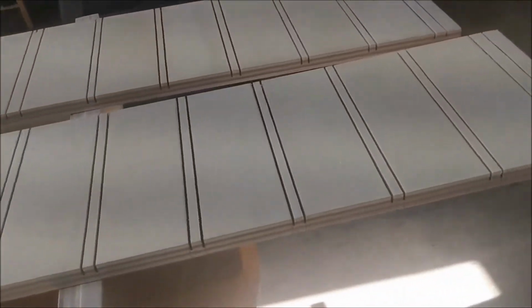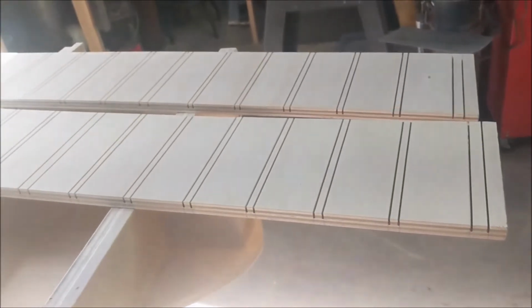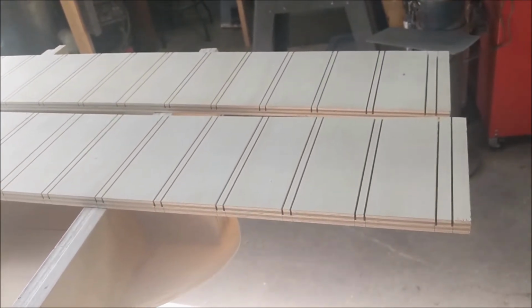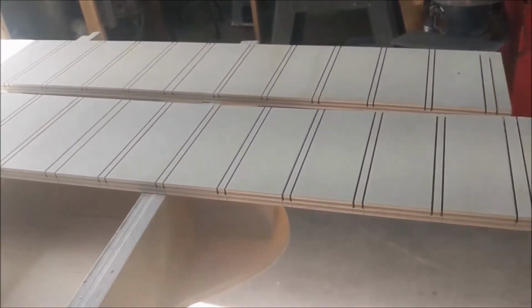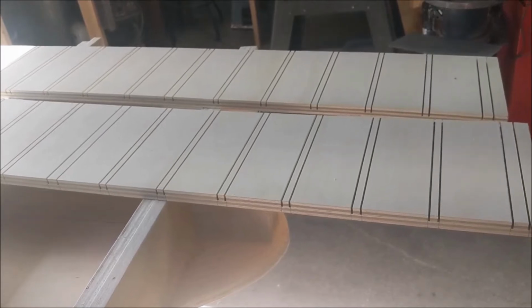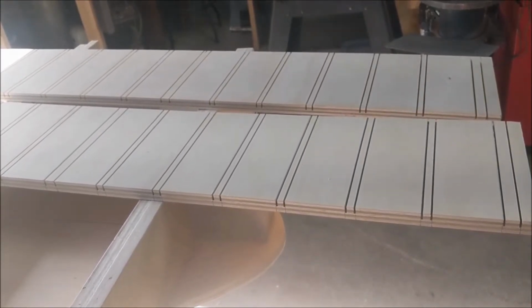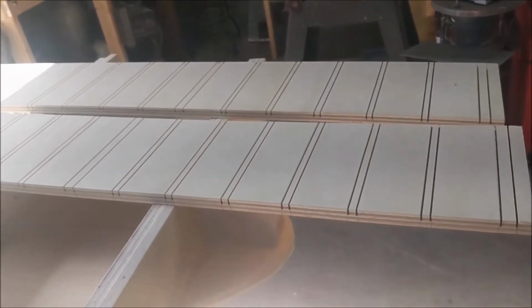The intent behind that is it's going to be a box. So there will be a 3/4 inch piece of plywood forming the bottom of the box, the top, and then also one mid-span to prevent any bulging, because it'll be critical that the sides of this cabinet box stay uniform for the sake of the design. You'll see what I mean here in a few minutes.